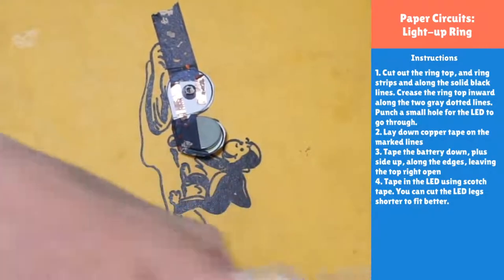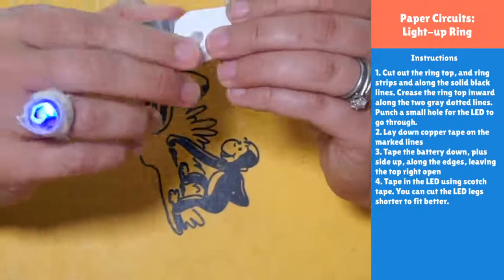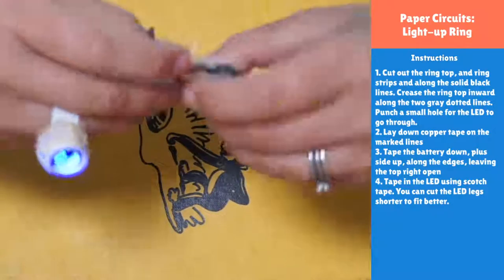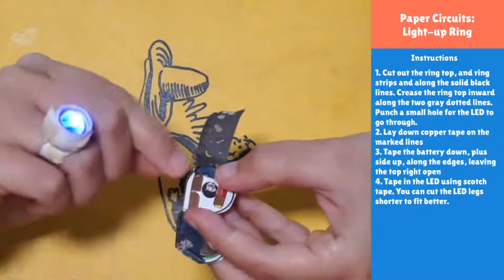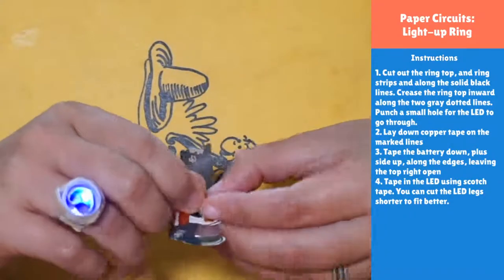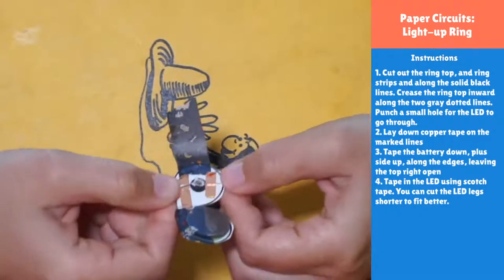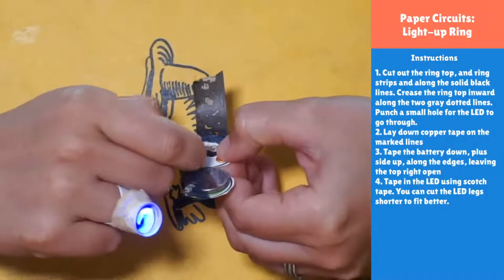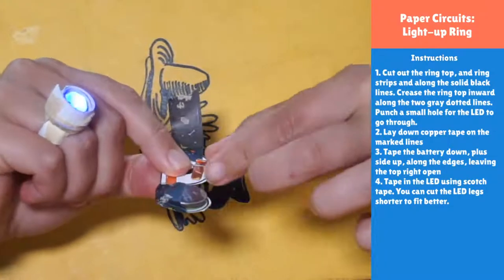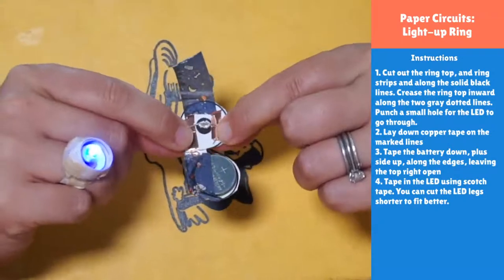I'm going to pass this over to Georgia for when she gets to our spot. Now we are going to stick the LED legs through the bottom. All right, so we want it so that you just stuck it through the bottom, the LED is on the top of that. And then we need to make sure that that short leg comes over here and the long leg goes right here. And we are going to tape in just the short leg. The long leg is going to stay out by itself. Now we could just make it do the splits like that, but then it's a little easier if we bend this guy down a little bit, so that they bend down and touch that metal a little bit better. All right, so it sort of looks like a staple now. The legs look like a staple.